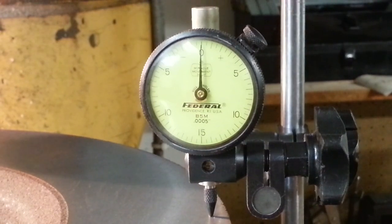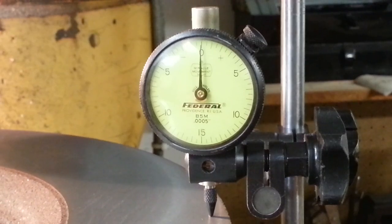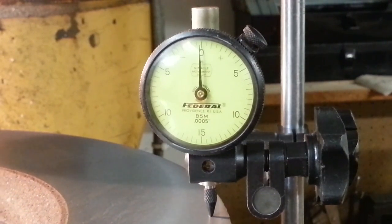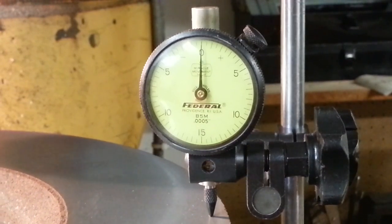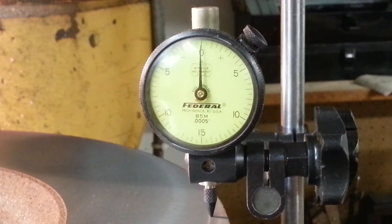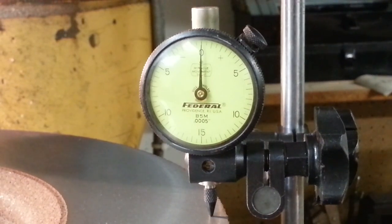So now we've got a zero. Moment of truth. I see a very small amount of waviness, which I'm not really all that surprised about because I wasn't keeping a super accurate speed, so the cutting pressure varied as the speed varies. I'd call that satisfactory — there's a few tenths maybe, but once it gets bedded in on the car it's not going to matter.